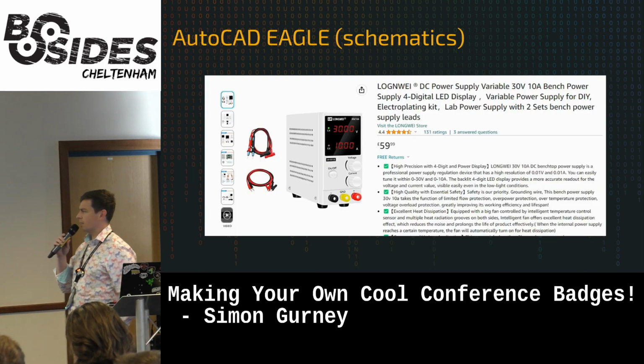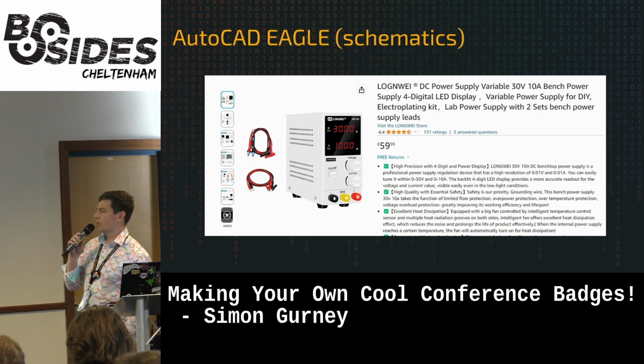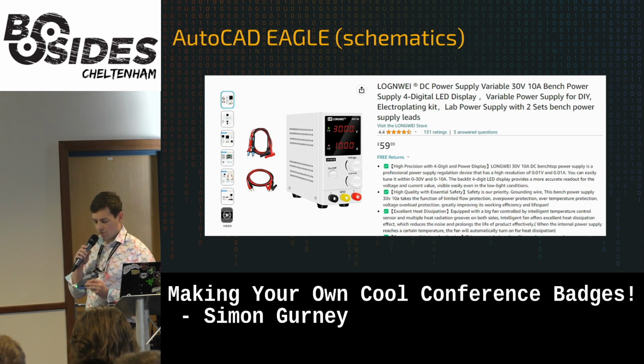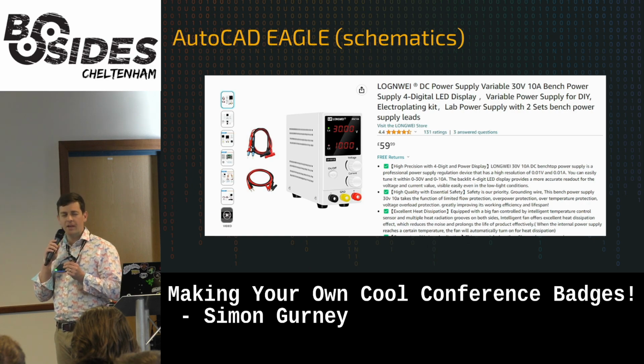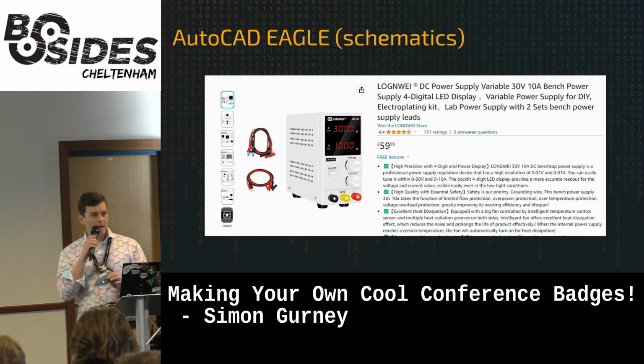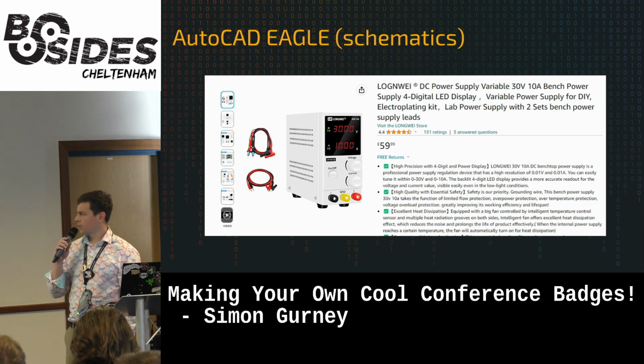And then these things are great. £60 off Amazon. You can set an arbitrary voltage and current. So these batteries, for instance, start at about 3.2 volts. As they drop off, they get down to about 2.3, I think, before they bin out. So you'll notice that your badges will start to go redder because red works at a lower voltage than blue. So you'll lose blue first.